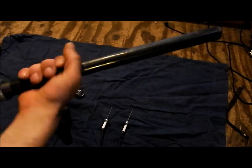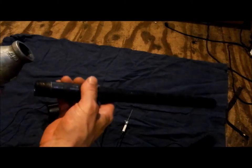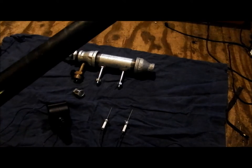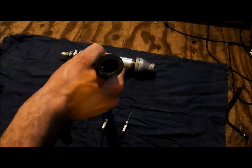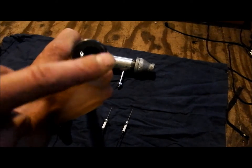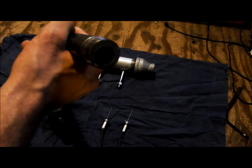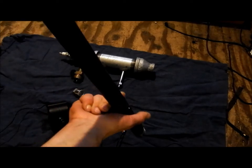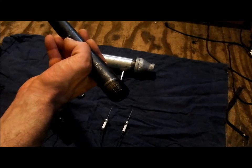This is going to be a takedown rifle, as in the barrel will thread out and the gun can basically be shorter and be put into a box or a bag. So it's going to be sitting on a rifle. Now this could be taken off the rifle platform, or I should say the rifle stock, and it could be a three-part gun or a two-part gun. I don't know if I mentioned this, so I'm going to go ahead and mention it anyway. I've choked out the breech a little bit. It's not really a breech in this case, because you're not actually putting a round in here. This is going to be a muzzle loader. I'm putting the round down the barrel, and it's acting more like a chamber just to catch the thing that we're going to be shooting.